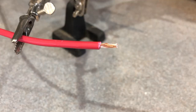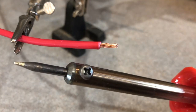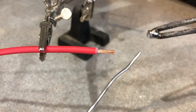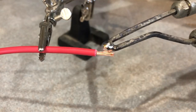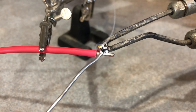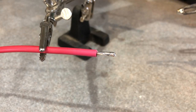That's a good solder joint. So here's some 10-gauge stranded wire. My little 30-watt soldering iron really wouldn't put out enough heat to make a good solder joint, so I've got to move up to the next size tool. As before, I'm pre-tinning the soldering iron and putting a little bit of solder on there. I'm not using that solder to try to fill up and tin the wire — I'll add more solder to the wire and let it flow in. That way it gets solder and rosin core all the way through every strand in the wire and that'll make a strong solder joint.